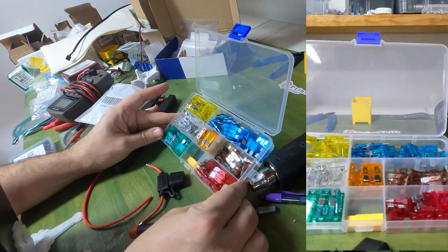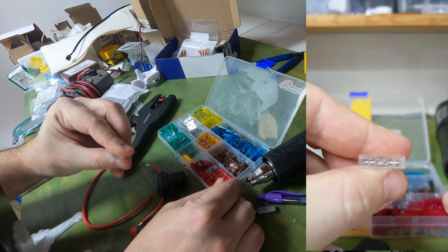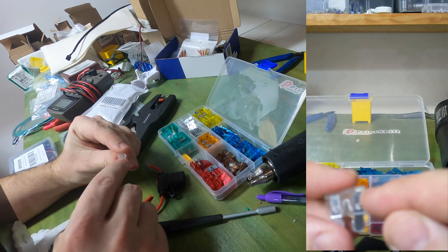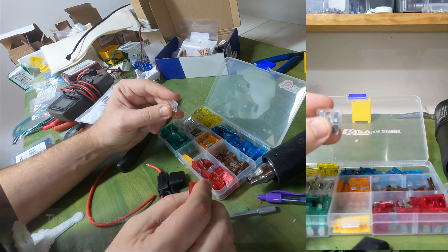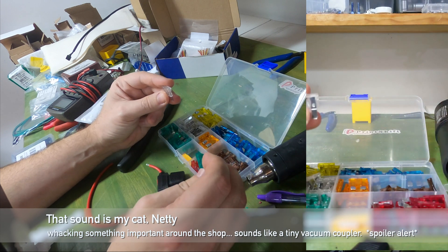The second big question about fuses is which one do you put in? It'll tell you the number at the top. This is a 25 amp fuse — see how thick that center wire is? That is what will break and melt if you put too much current through it. I looked at the documentation and the Duet would like a 5 amp fuse.